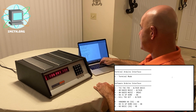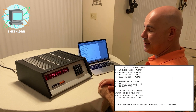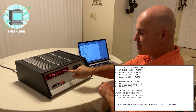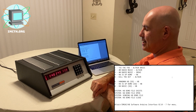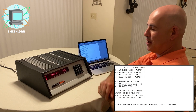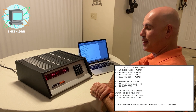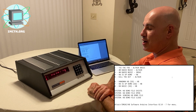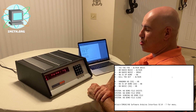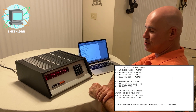I'm going to hit 7 to select H8 is up, and it's uploading right now. You saw the display was changing as the code came in — as each line of hex code arrives, it updates the address and data shown. To run the program, you just hit the Go button, which is number 4. It's now displaying 'H8 is up and running' and beeping. These LED segment displays are unable to render all characters, so it simply shows what it can, which is still very cool and confirms the machine is working.